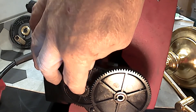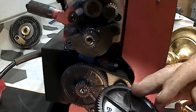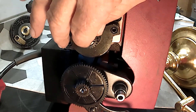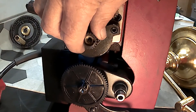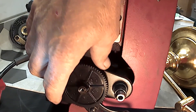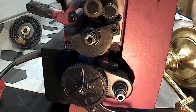The stock setup was 20, 80, 20, 80. I blew out my 80, so I'm running 20, 65, 20, 80. This one here is actually a metal gear — one of the 20s. This is, I believe, the 65. I'm going to leave that there because we may be able to use it to make up this new gear train.